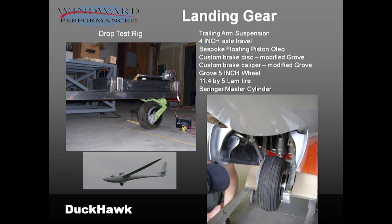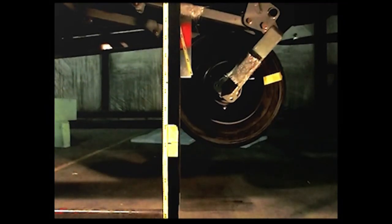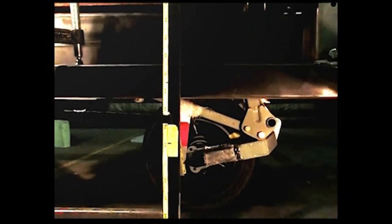The Duckhawk has very practical goals as well and a quite sophisticated suspension system on its landing gear. The retractable landing gear is electrically actuated — up and down is just a switch, no moving of a lever. But it has four inches of axle travel and a floating-piston oleo suspension system, which means there's a separation of the static spring rate and the energy-absorbing spring rate for a hard landing. The airplane sits at about 80% deflection statically on the ground, giving a low angle of attack and lots of aileron control. When you land, that full stroke is available. We're very happy with the drop-test and oleo-tuning results.